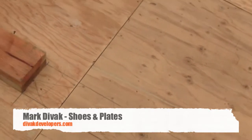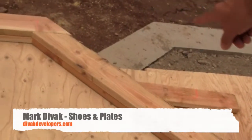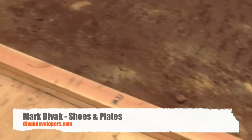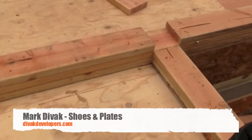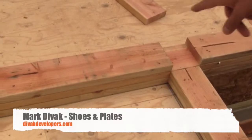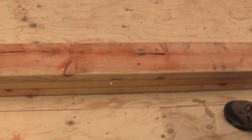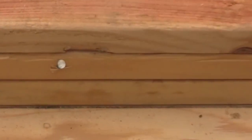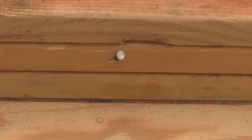There's one string line for the bottom and two for the top. Where you see three laid down, that's where the wall intersects and ties in together — that's why they cut it out like that. They'll tack all of these down: the two top plates to the bottom, and nail the bottom down because that's staying there.